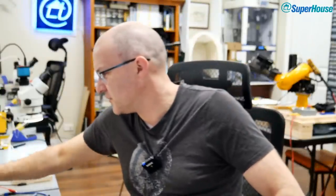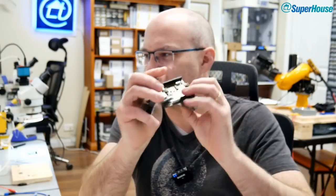That's the thing is, these donor boards that I've had sitting in a container and I've been pulling parts off, the reason they're sitting in that container is they were busted in the first place. So there may well be parts on them that are no good. And with boards like that, I normally pull things like resistor networks off them and, you know, passives like inductors and other things that aren't very likely to be a problem. But sometimes things like voltage regulators or ICs, they could be the thing on the original board that was dead. So who knows, that board might have had a reverse voltage applied to it at some point, or something happened that fried the regulator, and that's what has now caused a problem here. So I'm in two minds now about whether I put another regulator onto this and try it.